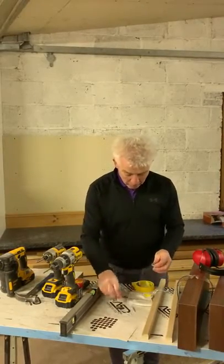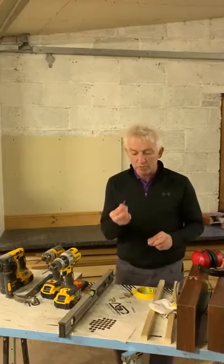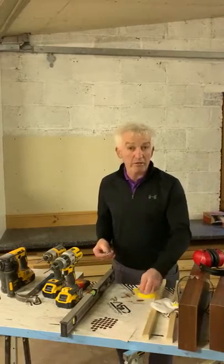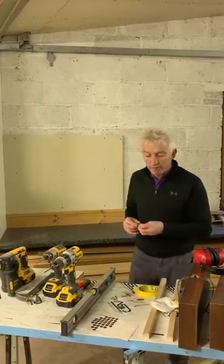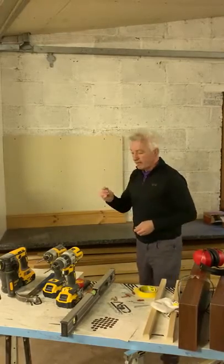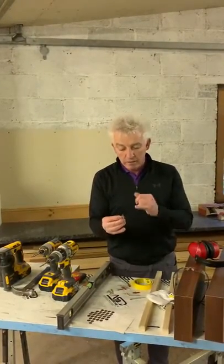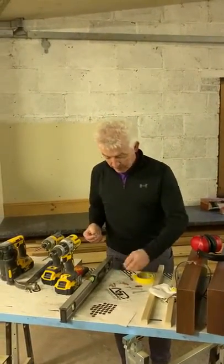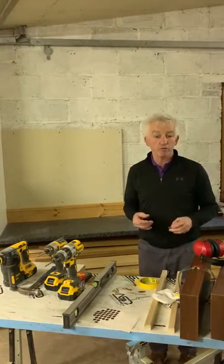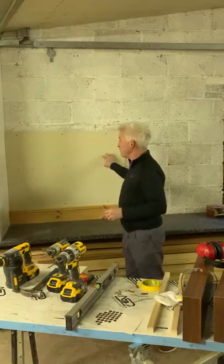These screws and plugs will come with the shelf you buy in the hardware store, but I have them here separately. I'll be using a masonry plug — you drill a 6mm hole and then use a 4x50 or 5x70 screw, whatever size is required. For the plasterboard wall, we'll find one stud, but where there's no stud, this little gadget comes in — some people call it a hollow wall fixing, a plasterboard fixing, or a worm. It screws into the plasterboard and then you can put a standard screw into it, giving you a secure second fixing. On a shelf, you'll definitely need two fixings; if it's longer, you could need three or four.